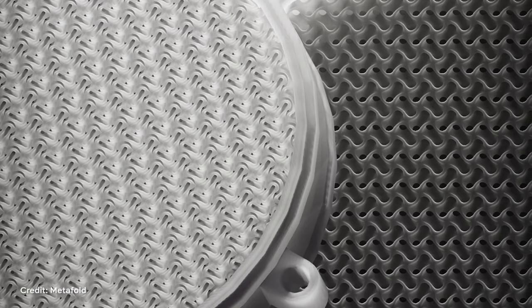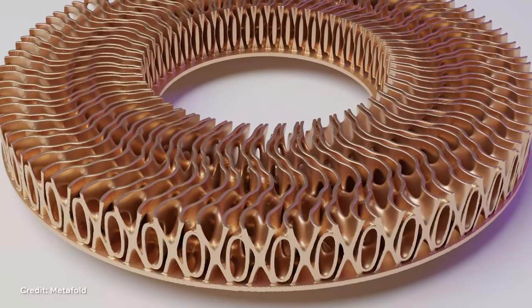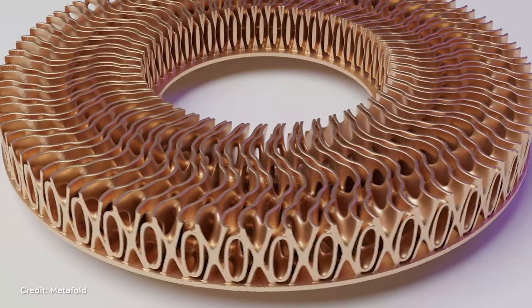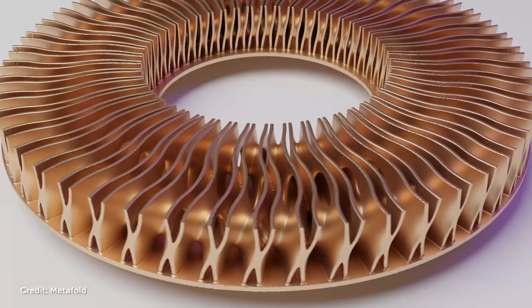This is actually fine for most manufacturing methods. With conventional manufacturing, you don't need a lot of surfaces to represent most shapes. Not the case for 3D printing, because in 3D printing we have this new opportunity to create very high surface area structures with lots of fine details. If you think about trying to represent every piece of surface in these high-complexity structures, you're talking about a lot of triangles — and you may find that some STL files can be many, many gigabytes. Metafold uses a different approach: implicit modeling, where the form is implied using equations capable of capturing the geometry using a lot less data.